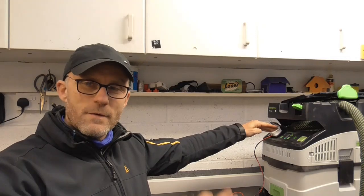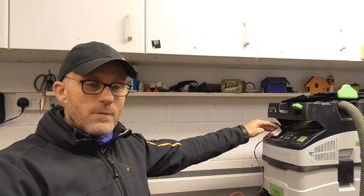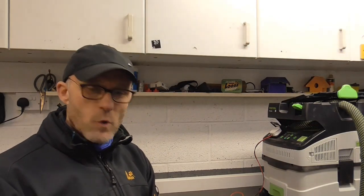All these machines have this accessory port, which is what you plug your power tool into. It's voltage sensing, so when the voltage drops it starts the extractor up, and when the voltage is cut it then overruns a little bit.